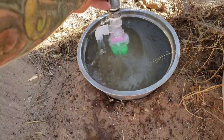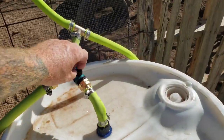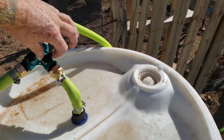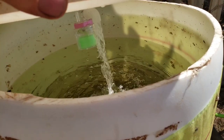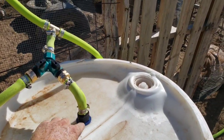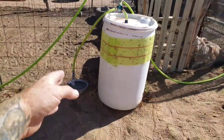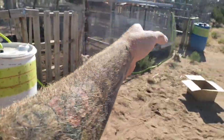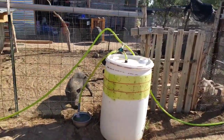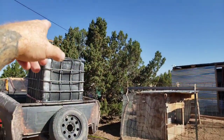With that out of the way, I know how much hose I have left so I can use it to connect my livestock waterers. I tried to go without thread tape and they were leaking, so I had to go back and put thread tape on everything. But you can see they're doing exactly what they're supposed to — this one I just shut the valve off, so everything's already full. It was crazy fast. The dogs can water this pen, that pen, that pen — they can all drink any time they want, and these containers will remain completely full. Once the water tower gets low, it'll activate a pump from the 3,600-gallon cistern and refill it. So everything is automated.